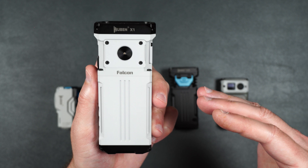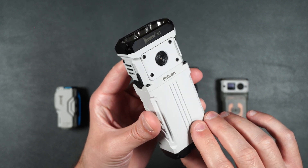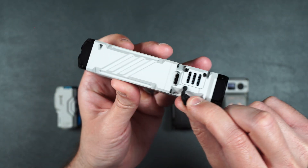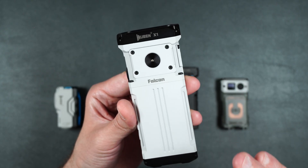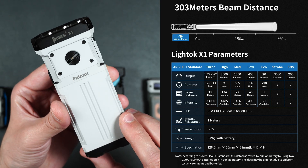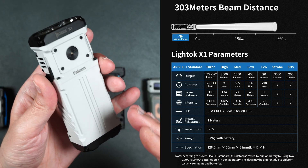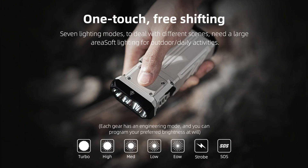It also has stable illumination for 1.7 hours at 3,000 lumens. You can charge it in just two hours using the USB Type-C port, which is covered for waterproofing. It uses two 21700 batteries with a total capacity of 4,800 milliamp hours and up to 220 hours of battery life. It also has an IP55 water resistance rating and three large LEDs. The X1 has seven different modes of operation: moon, low, medium, high, turbo, SOS, and strobe.